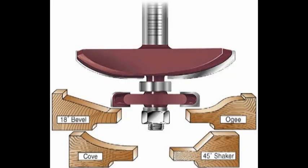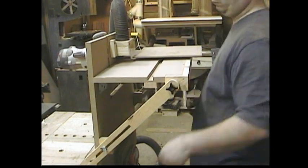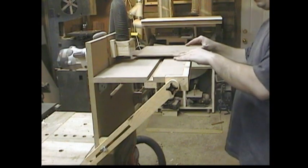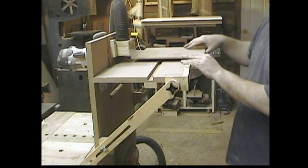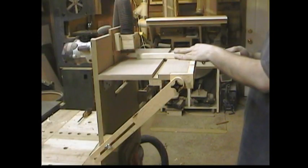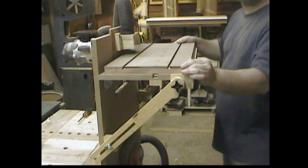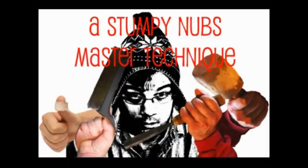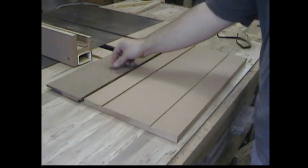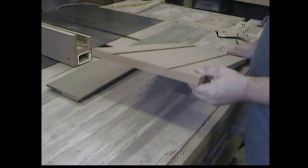You can even flip it over and cut a rabbet on the back — something that really sets it apart from a simple table saw jig. It's actually a great way to cut rabbets or tongues on the edge of any panel. It's fully adjustable up and down and the angle can change however you want. Rails and stiles, even angled mortise and tenon joints can be made using a sled that runs in a miter track. It has T-tracks on top that provide a lot of clamping options and multiply what this machine can do. T-track is great for making all sorts of jigs, but it's expensive, and this machine needs two long pieces of it.